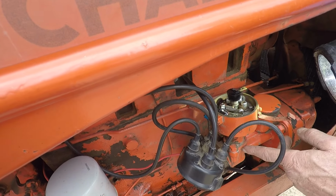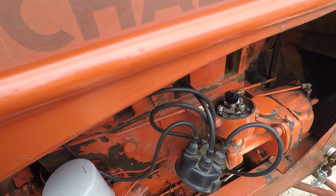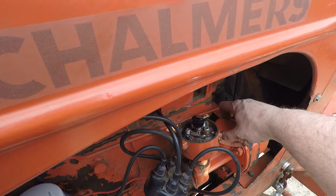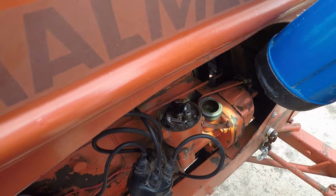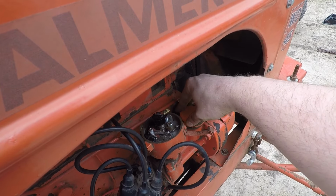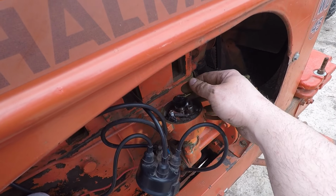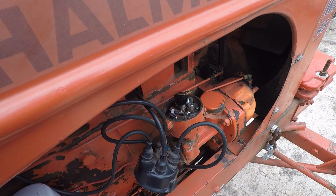and turn the distributor. But see, he hasn't done anything there, I don't think. So how could that have moved? Well, that's what I'm thinking. Maybe that drive is bad in there, but I don't know that. Yeah, the gears are back here, so we probably won't be able to see it. Or, you know, maybe they had the points set real wacky. Or maybe the shaft is bad in this.